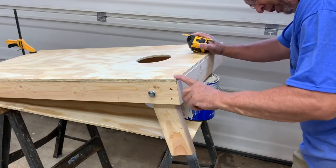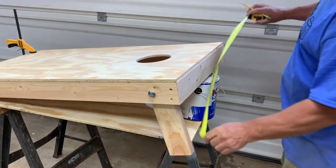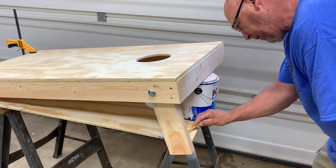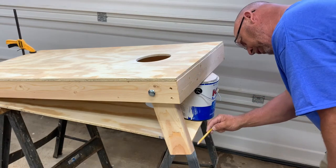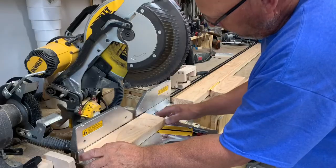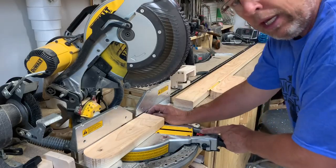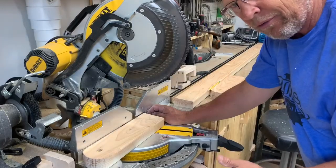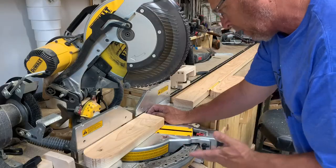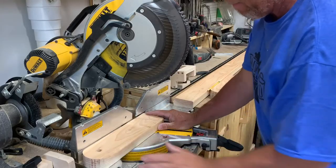The back end here needs to be 12 inches off the ground at the top. We'll get the leg down and then mark it before we cut it. We're going to cut this little angle here — my angle ended up being just about 20 degrees. Everyone's going to be a little different; it just depends on how your leg sits. You've got to put your leg down to mark it, so it's not all going to be 20 degrees. Mark it and just cut the line.